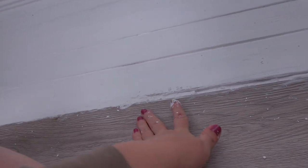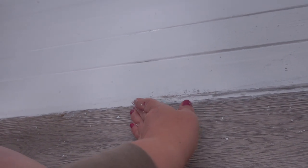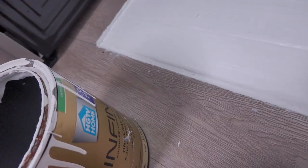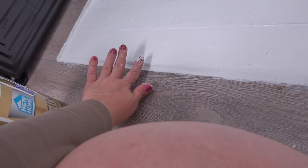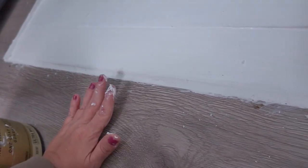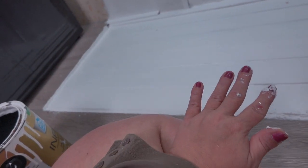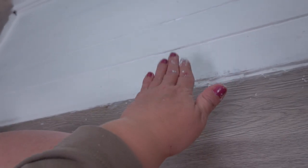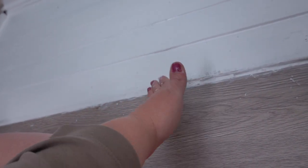Okay, I have put the styrofoam down and then the caulking on top of that. What's going to happen next is after this dries, I'm going to put black tape here, the black duct tape. After this dries, put the floor over top of it, this peel and stick floor. It sticks really well to duct tape, actually, and the duct tape helps to balance the uneven floor so that it won't just crack. It has some flexibility to it. That's all I can say.